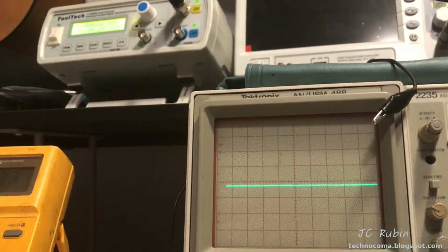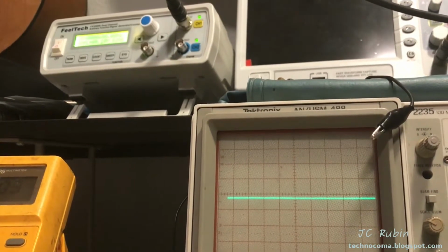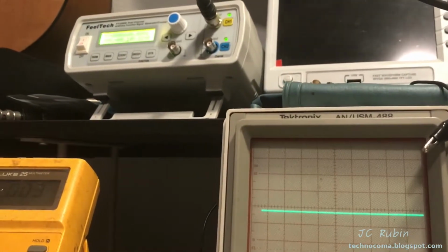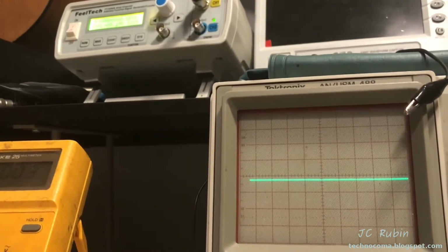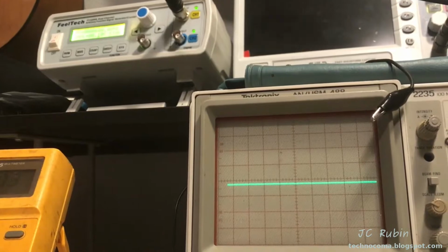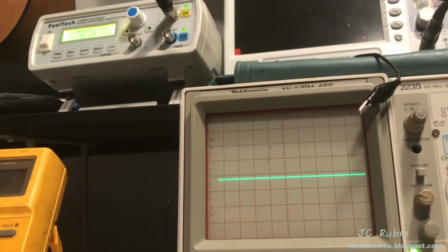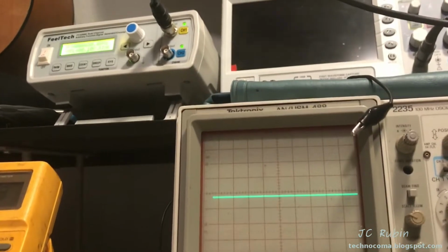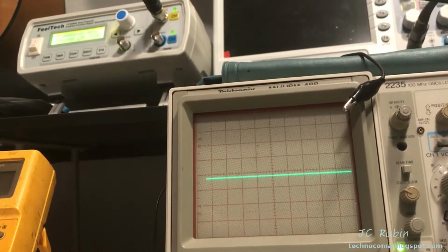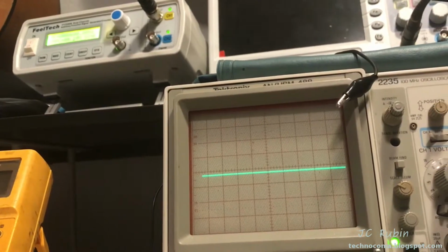That's awesome. Again, I'm going to point out that it is hard to measure distortion there at the top end of the input because I'm using a function generator, as you see, and I'm not using a guitar pickup. So I don't have any reference. It could be a much lower voltage than I'm using with the connector that I have in line, my resistor in line that you can't see here because it's down on the floor. So I can't say. So maybe it would be less of a signal and it would stop before it would start distorting and clipping on top.